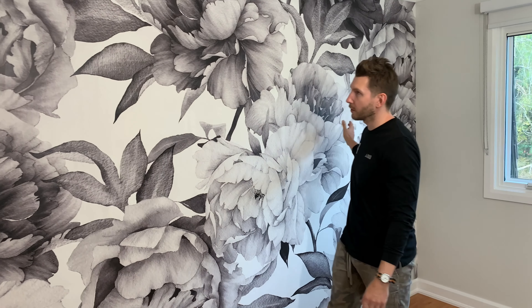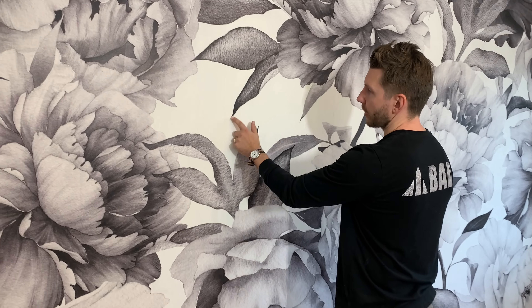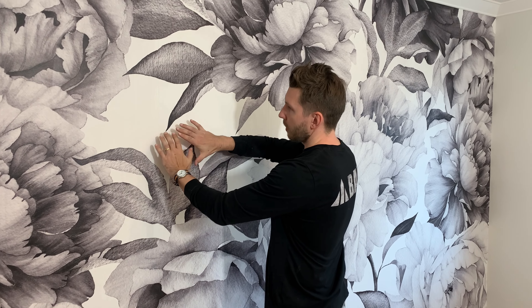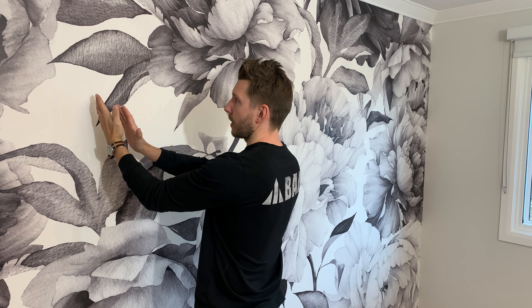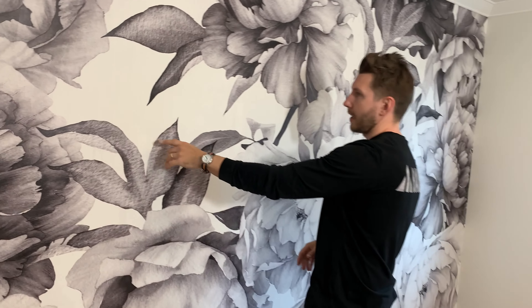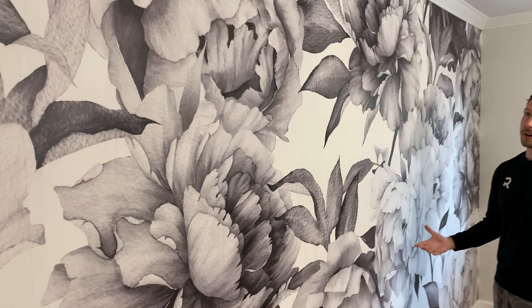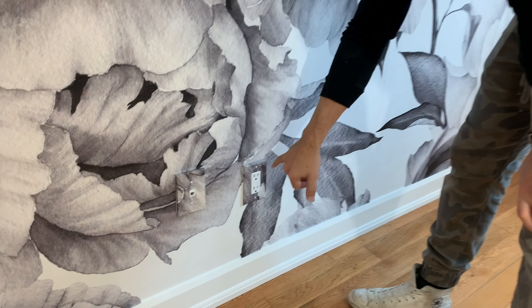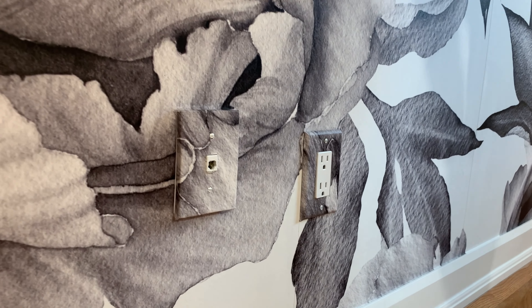So there you have it — it's all done. The mural is fully complete and we're pretty happy with how it turned out. There are a few interesting things about this mural that differ from standard wallpaper. One is the quarter inch overlap they call for on all seams — that's got pros and cons. The pro is it's easier to install and ensures the seam doesn't split as paper dries and can shrink. The con is you can see the lip where the two pieces overlap, which is a preference thing. We've also done a cool detail where we've wrapped the outlet covers in the wallpaper itself to give it a unique, hidden look. Subscribe, like the video, and see more stuff like this.